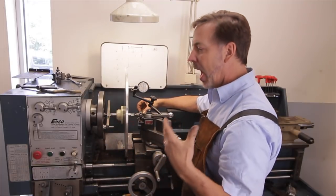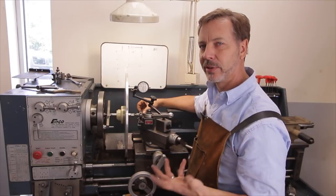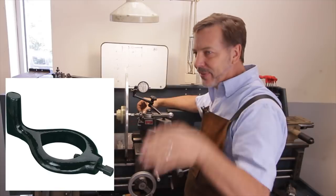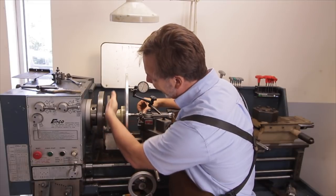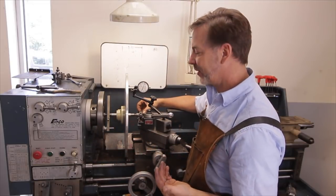Now the dog is something I made. I don't like traditional lathe dogs even though I do have a set of them, because they're off balance — when you're spinning, the machine will slap around a little bit. They're actually kind of a bad design. So I made one that is equal on both sides so it weights out correctly.